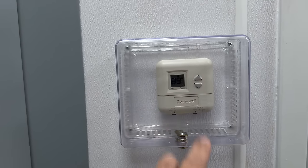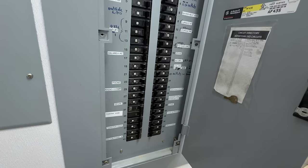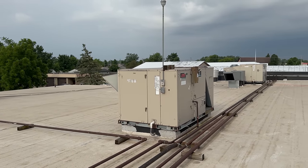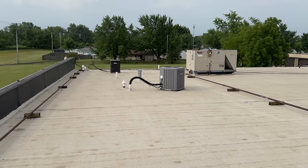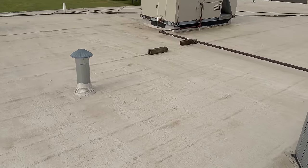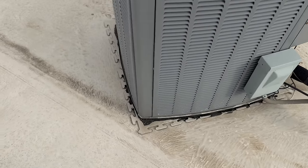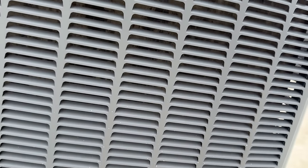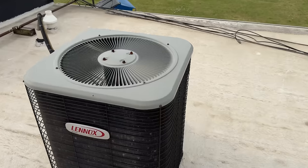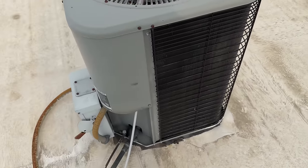It's really warm in here — they have no cooling. They left it on, didn't shut it off. That should be the first thing the office should be telling people — to turn things off. All our breakers are on. Let's go upstairs and see what's going on. I've seen these units from below and thought, oh boy, good old Lennox. But instead we've got split systems — which is always such a nice cost savings. The front part of the store is cool. Feels like we're pumping heat. See how bad our coils are — you know these never get checked. Slightly packed, not too horrible. Here's a high-quality Lennox — no fan, and it's running really hot. So instead of shutting it down, we just let it run and cycle off of that — which is why you shut it down.